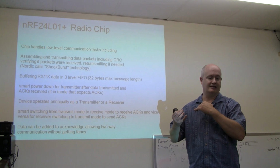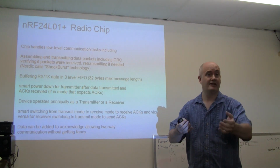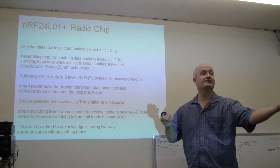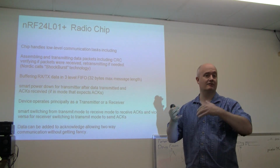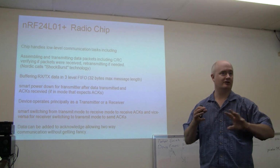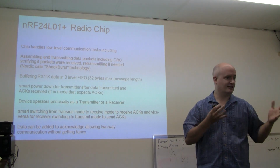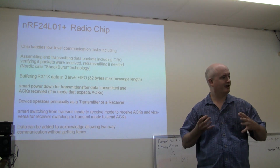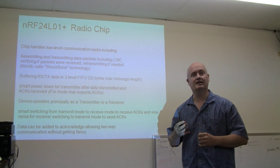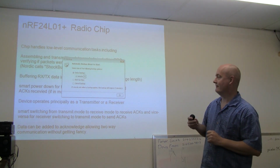The thing is that the device can do some of the things Dick was talking about, where it sends the data, and if you wish, you can have the remote device send an acknowledgement back if it received the data and the checksum worked, where it feels like there's a high probability of no errors in the data. By the way, you can still have errors if you have the CRC check. I think some people think that guarantees flawless data. It just guarantees a high probability that if everything matches up, there is no error.